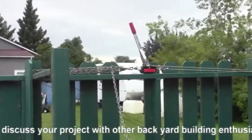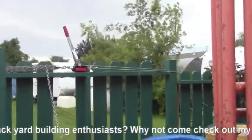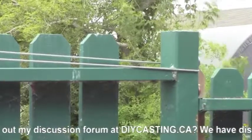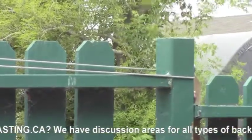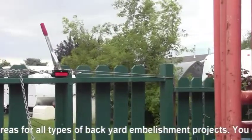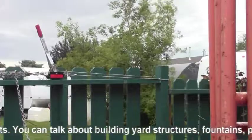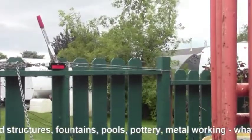Now I found that wasn't quite enough force to pull that post back enough, because up over here, just zoom in there, that had actually separated from that post, it was hanging away about 1.5 inches, and the whole fence section was falling away. But with the two come-alongs together, I've actually been able to put enough force to bring that back in tight. So now I'm just going to put a couple of 3.5-inch long wood screws in there, and sink them right into the post and get that held good and solid. And then I'm going to start doing some cross bracing to hold that section together.